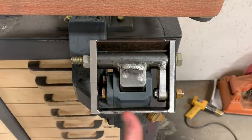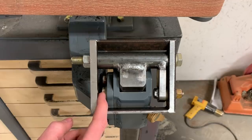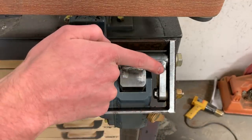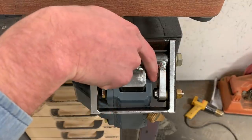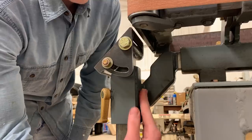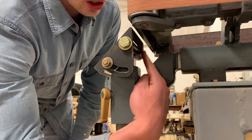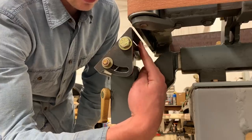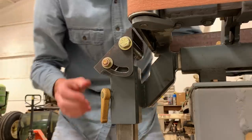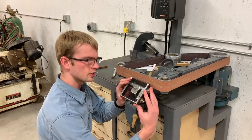This side of the frame had to be far enough over that it would clear this corner and this bolt, which coincidentally is the same distance over that this side had to be to make room for this piece to extend past the side of the table tube to hold the locking mechanism. The back of the table tube and this edge of the table frame and the back of the DOM and the top of the table frame all need to be in line so that this can get as close to the belt as possible, but yet this still clears. And then also when you tilt this back to vertical...